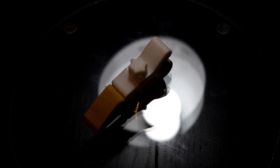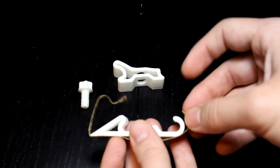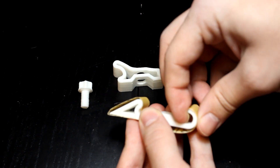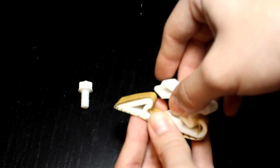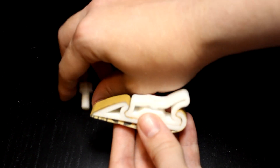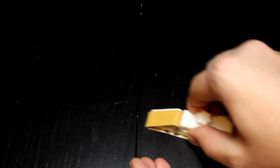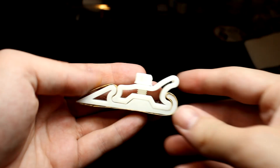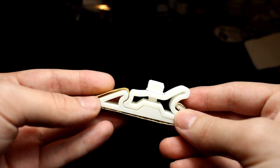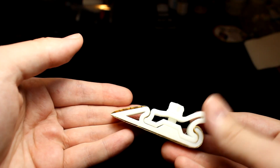The block works by placing sandpaper along the bottom and wrapping it around the top edges, then sliding the top piece in and screwing the screw through the hole to hold everything secure. You just cut a strip from a regular sheet of sandpaper with an exacto knife, fold in the edges, slide on the top, screw in the screw, and you're ready to go.